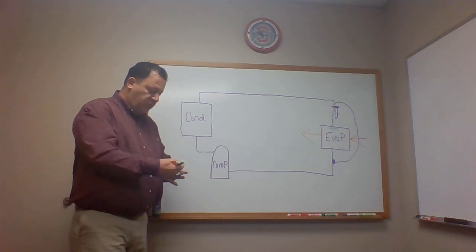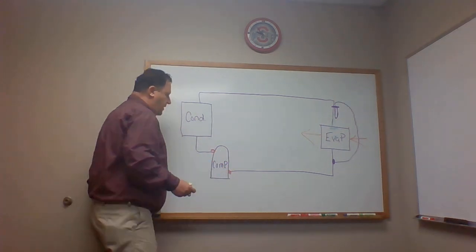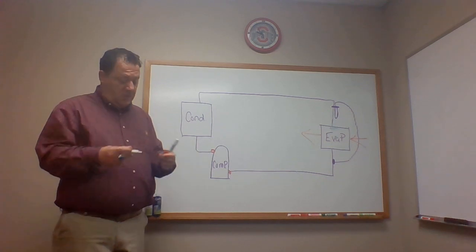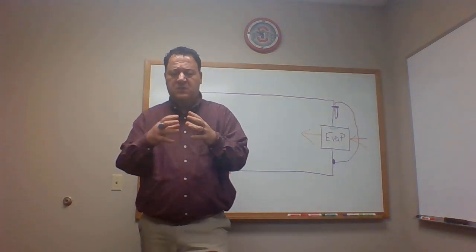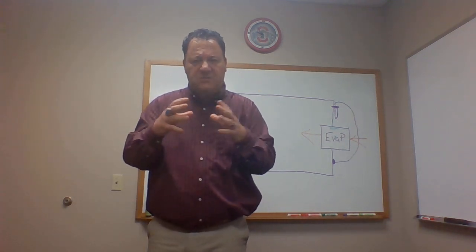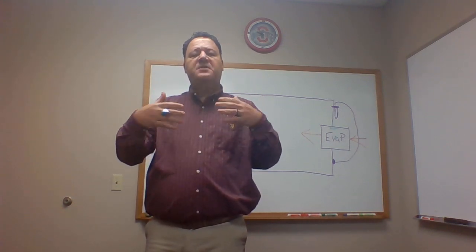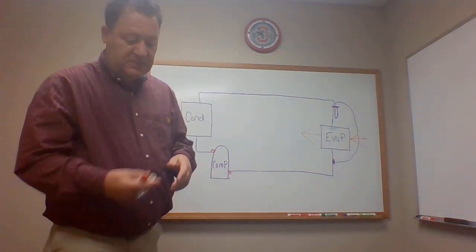So just to point out to you, I know everyone knows this, but this is for the folks that are just getting started. Maybe this is day one. This is the lowest point of pressure in the system. This is the highest point of pressure in the system. The whole idea of the compressor is what? We're taking those molecules, whether it's a scroll, reciprocating, whatever it is, we're mashing those molecules up, and the tighter we make them, the molecules start to move faster and they get warmer, okay? Anytime we raise our temperature, we're raising our pressure, right? And that's the whole idea of it. Because that's what this thing's doing. This is our pump.